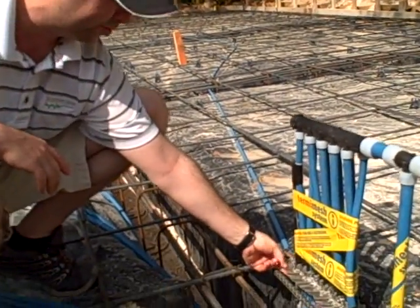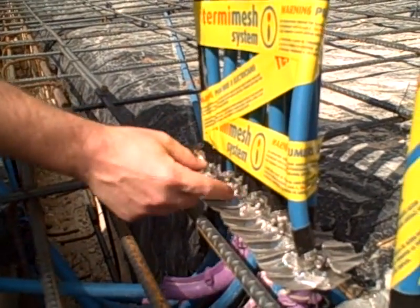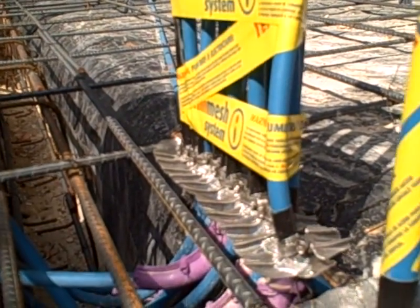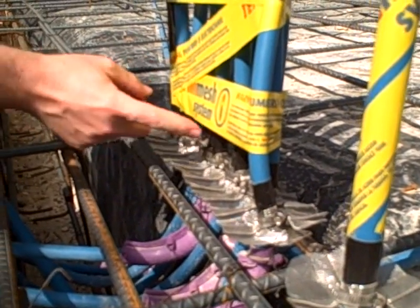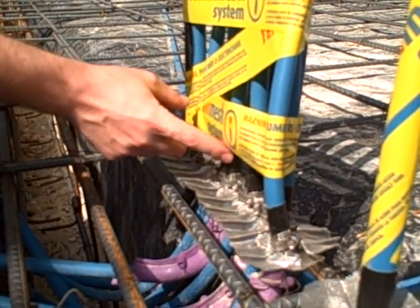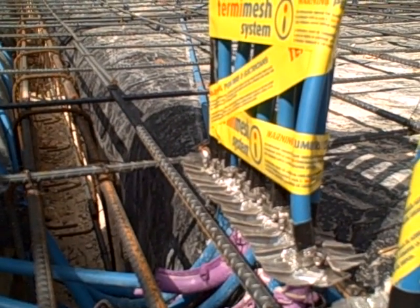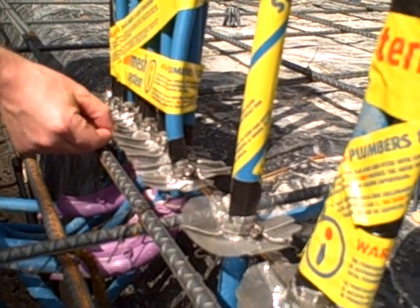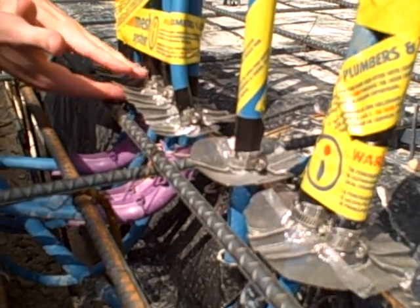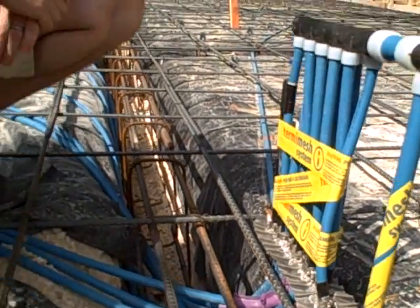This is a really fine stainless steel mesh and we use a stainless steel collar around all the penetrations — these are water pipes. A termite that tries to come up and tunnel in between that pipe and the concrete — the concrete doesn't adhere to this pipe — so there's always a little bit of a tunnel that can be a point of entry for termites. This prevents that entry. So when the concrete is poured it's going to lock in there and provide a lifetime of termite protection for this house.